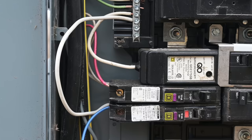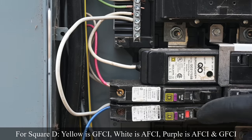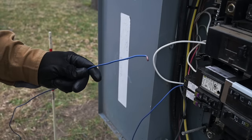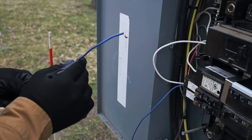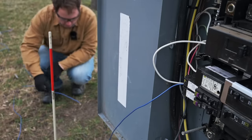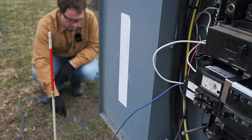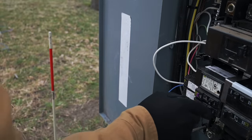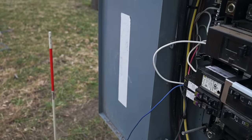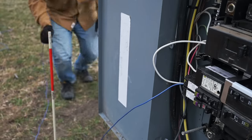Anytime you see a test button on one of these breakers, it means that it's going to be AFCI, GFCI, or both. I'm going to turn the breaker on again — this is going to be the live end that I'm holding, so we should have 120 volts on this end right here. If I touch this to the ground anywhere, even if I just barely touch it to the ground like right here — watch what happens. There it went. Let's do it one more time. 120 volts are on this wire right now. Let's just gently touch it to the ground. Just like that — it trips instantaneously.